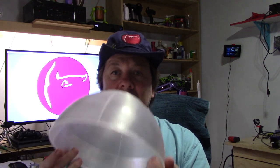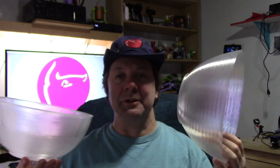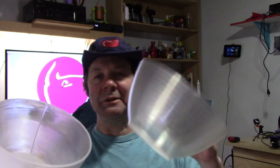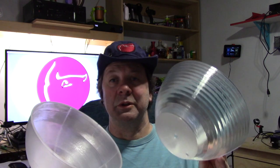That's what made this one the way it is. This is actually the same thickness — only 0.8 millimeters wide — but with a 0.4 nozzle it went back and forth making two shells, and it's kind of cloudy. Part of it is also the same exact filament — literally the same roll of clear filament. I've probably had it two or three years; I very seldom use clear. Having the large format printer gives you options to do things like this. You can see the ribbing in it — that's pretty cool. The large format printer with the larger nozzles gives you sometimes better results than the little nozzles, depending on what you're looking to do.